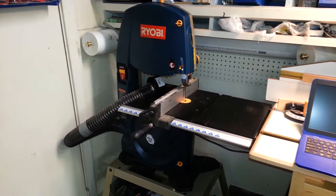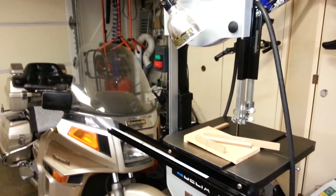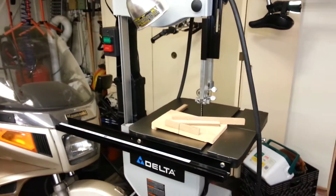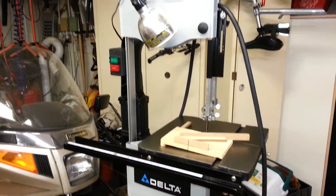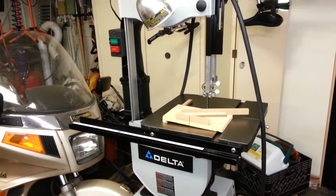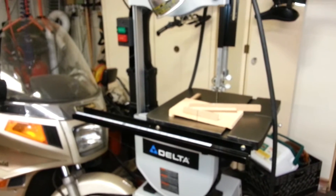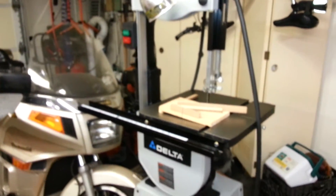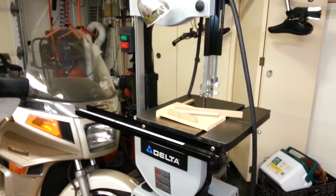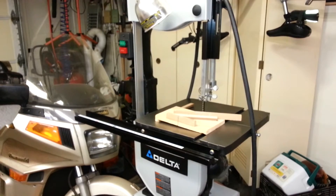I have another lathe — my Delta — which I'll show you here momentarily. I did mention this is a garage shop, so you're going to see some things in here that are kind of garagey, like my Kawasaki Voyager right next to my 14-inch Delta bandsaw. This is the one I use primarily for resaw and also for breaking down large stock into blanks. A lot of bowl blanks cut up on here. It's got 12-inch maximum resaw capacity since I added the 6-inch riser block to it. I have replaced the motor — it had a 3/4 horse motor and I went up to a horse and a half. It does the job, not quickly, and wet wood will slow it down a little bit, but I keep a good sharp blade on there and it does just fine.